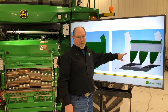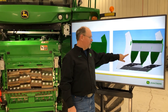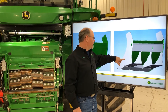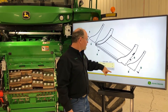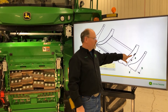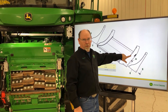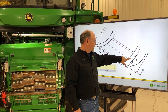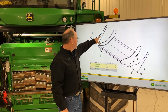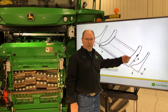These spiral bands can be retrofitted into pre-2019 model year 8000 series machines as well, but you have to remember that the cutter head on the 9000 series is a little bit narrower due to the thicker side sheets. So if you put these into a pre-2019 model machine, you also need to get the appropriate shims in order to fill up that gap.